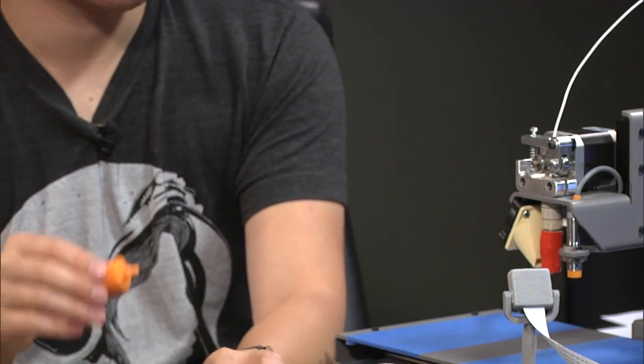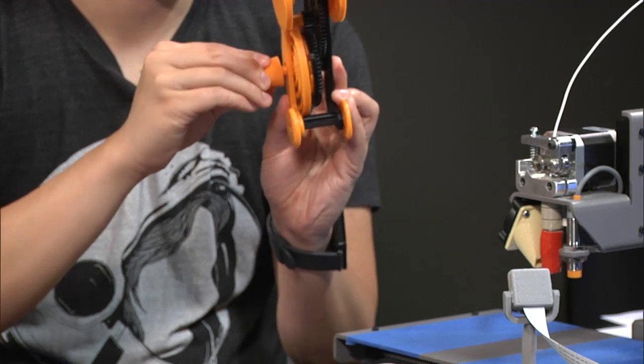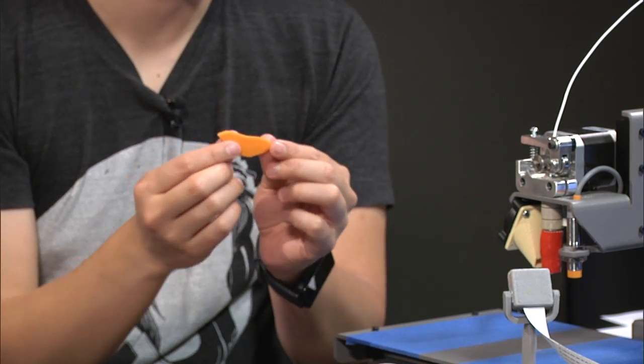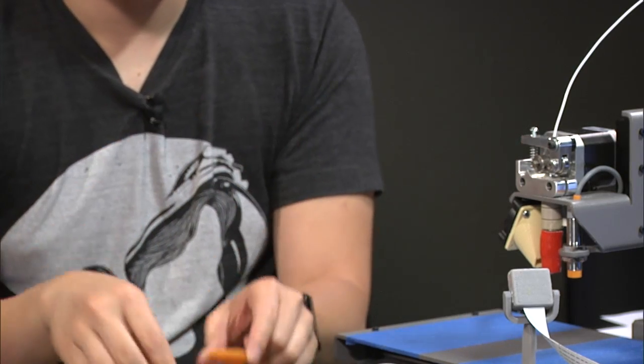The more infill and the more perimeters and the bigger your object, the more time it takes to print, because the speed of that tool head is a relatively fixed variable. So it's not going to go faster if you have more stuff. The more filament you put down into the object, the longer it takes to print, basically. There are literally dozens of options in here. You can go down deep, dark rabbit holes testing this stuff and figuring out what works and what doesn't.